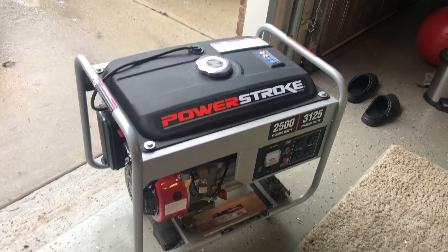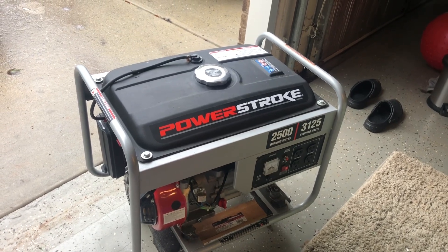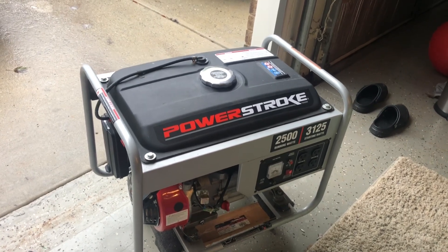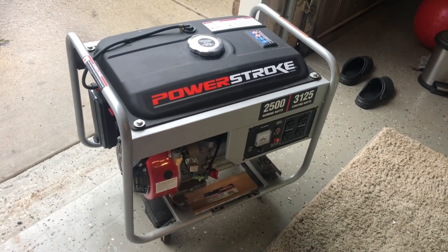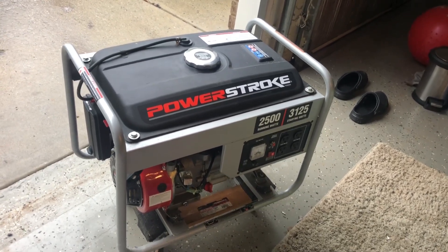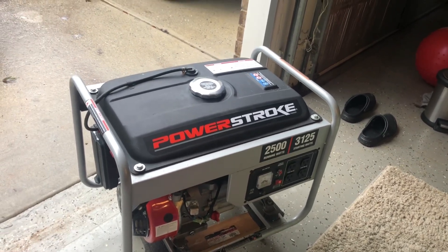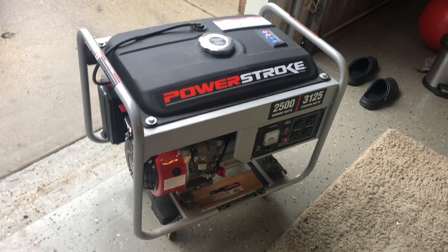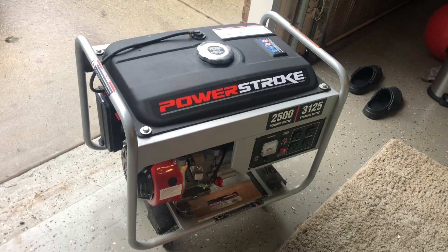Be safe — run them one at a time. If you have a freezer in the garage, plug this thing up, let it run for an hour, and that should keep everything frozen for up to four hours if you don't open it. Then in another four hours you could run it for another hour again. Same with a refrigerator — it depends on how much you open the unit, but it can really save your food. Even at night it can run lights easily in your house. Make sure when you run one of these things that it's always outside — run a cord into the house and put the unit outside. A lot of people die from carbon monoxide poisoning from these things being run in a garage attached to the house — super dangerous.